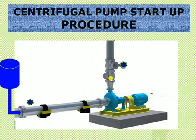We want to push the air out and replace it with liquid in order to get proper pumping. When there is any air pocket available in the pump suction, at the eye of the impeller, or inside the casing, the pump will definitely not work and will not meet our process requirement. In a centrifugal pump with flooded suction, the liquid is available up to the pump level.